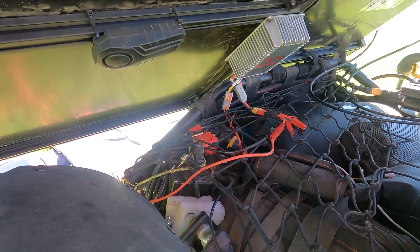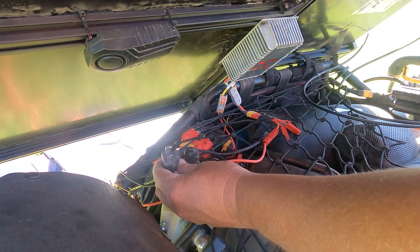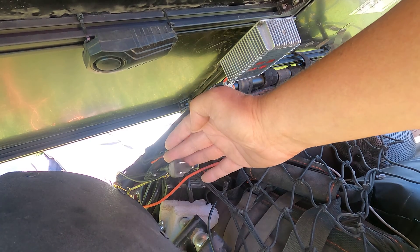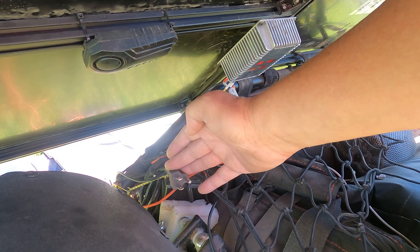The other way I plan on keeping this beast going — I'm going to be using a lot of city roads and highways, so there will be stores along the way — is I have the 110-volt charger on it. This is a 10-amp charger at 48 volts, pulling about 500 watts. It can charge up pretty much the whole system from zero in four to five hours.